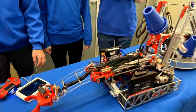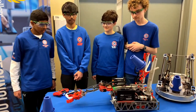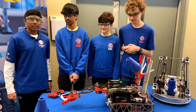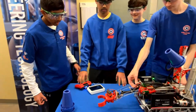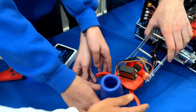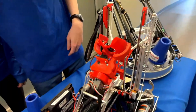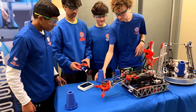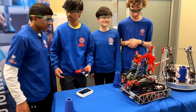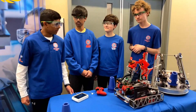From a programming perspective, what automations do you have across the entire intake subsystem — extension, claw, arm, wrist? You guys don't miss cycles and every score is super smooth. In teleop we have a distance sensor that detects when the cone is close enough, then it automatically closes the claw, brings the arm up, rotates it, and takes it to the deposit. In autonomous we use pretty much the same algorithms as teleop.